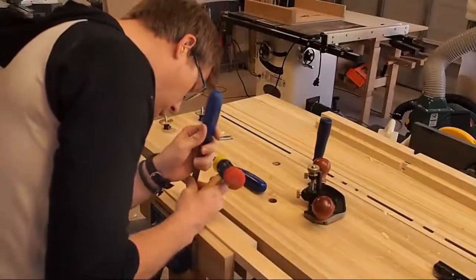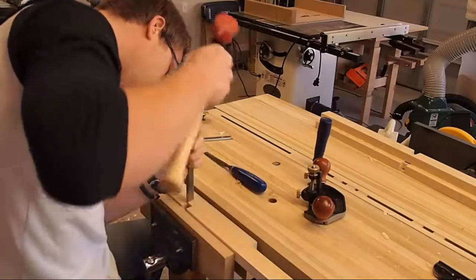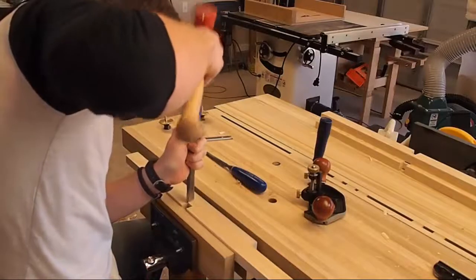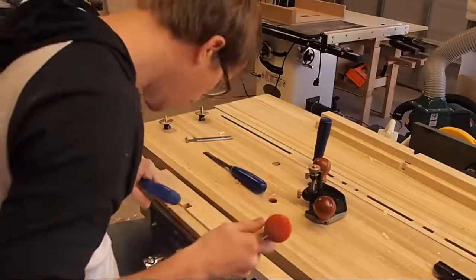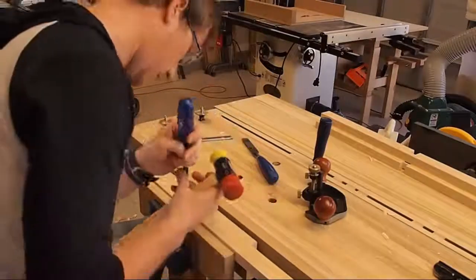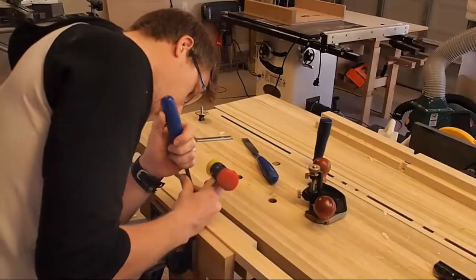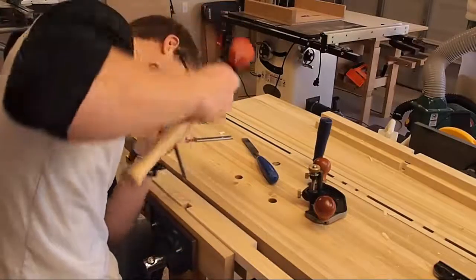After the initial notch is made, I use a chisel and router plane to finish off all the leg joinery and marry it to the shelf notches. I continue to eat away on both sides of the leg until it gets a nice snug fit onto the shelf notch. I want it to where I don't have to press it real hard, but at the same time it won't fall out if I hold it upside down.